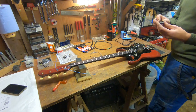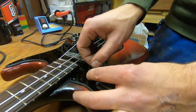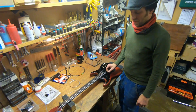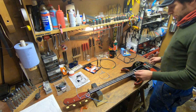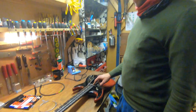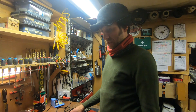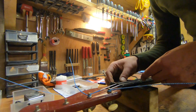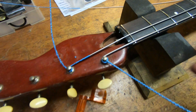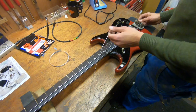It's got a few quirks so I've got to glue this on. This switch, which is quite a beast — it's got a bit of torque on there — requires this to be glued on in order for it to function. Yeah, but it works. The pickups were both not working properly: one not at all, this one not very well. They've both been re-tinned, so now we get the full connection — the ground and hot. The nut, as you can see from above, the spacing is what it is, but it's original and that's how we're going to leave it. All in all, this should make a noise in the next 18 minutes.